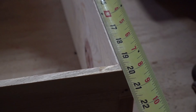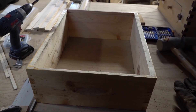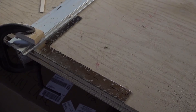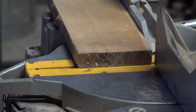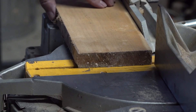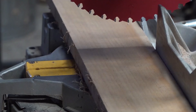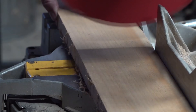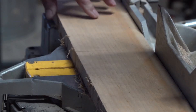We're going to make that shim. I found a piece that's five inches wide already, so all I have to do is cut the lengths and smooth it down a little bit. I also put a nice straight edge along this piece of wood so I have a reference that's 90 degrees when I'm squaring things up. Now we're going to cut the ends off here with these Diablo blades — those things are super sharp, if you've never checked those out look into them. They cut through wood like butter. Then we're going to cut the next one and cut the lengths.